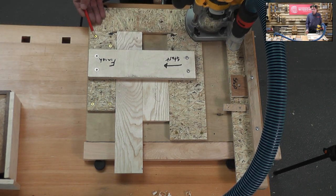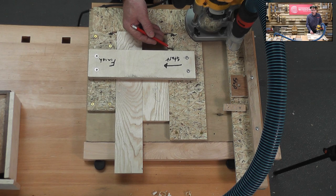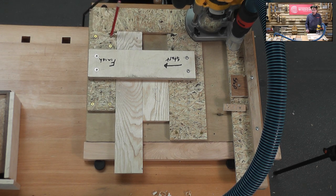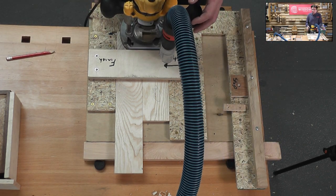Wood screw. If it's not countersunk in, raised up, the tip head might protrude. Likewise over here. Likewise, don't go having a screw, and I put one in here, but I moved it because the cutter's actually gonna come through there. You don't wanna touch the screw head on the cutter. It's not desirable, okay? We sell more router cutters, but it's not really the best way of getting over it.